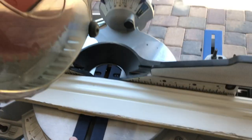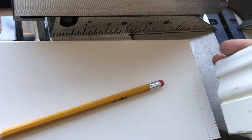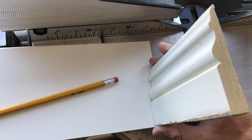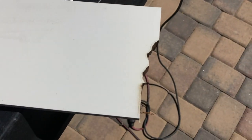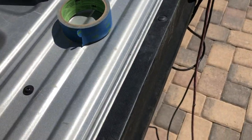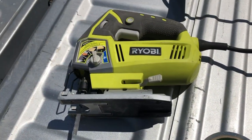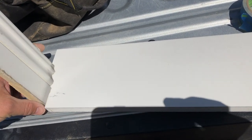I made sure I kept a couple of pieces big enough to use. I put them on the chop saw, cut a nice clean piece from that old baseboard, and then used the old baseboard profile to trace onto the side of my new baseboard. That way I could trim it down and have it fit nice and tight against the existing baseboard. I used a grinder to grind away the material — another method is to use a jigsaw to cut away most of the material first, then go back in with the grinder to get closer to the trace lines.